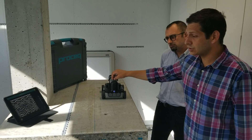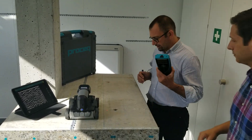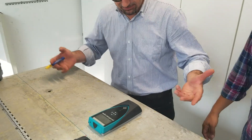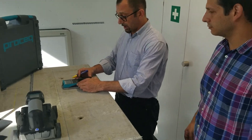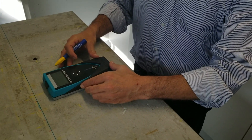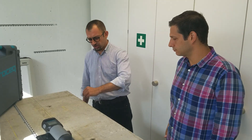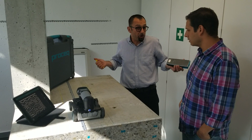In order to find that out, we're not going to use the dielectric really. What we'll use is the profoscope in order to find it. So this instrument is very simple to use and it's quite limited in capability compared to GPR. But it has a specific function — its weakness becomes its strength in terms of being totally independent. Now I'm marking this rebar here, and my reading is 23 mm plus or minus one in this range. I don't care whether it's green, fresh, old, porous concrete — this thing is totally insensitive to anything else.